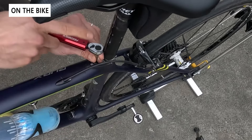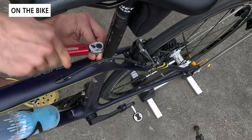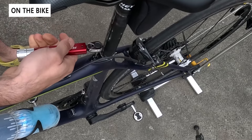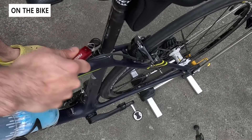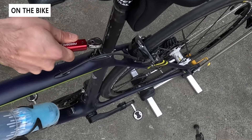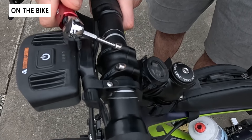It's very easy to use — once you want to tighten again you just go ahead without having to mess with anything. We do wish the torque range indicator was a little easier to understand for incremental settings like 6.2 newton meters. When you hit the final torque setting, you get a very satisfying click — even at only six newton meters here it's a strong reaction, so it's very obvious once you've hit that setting.